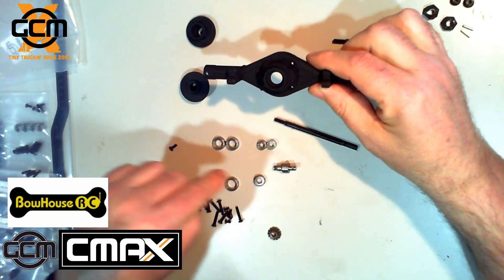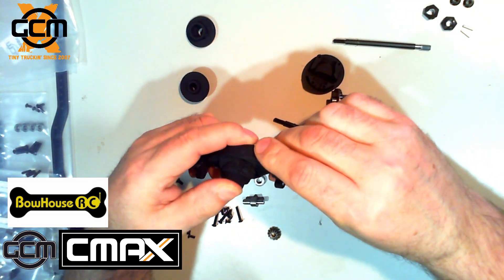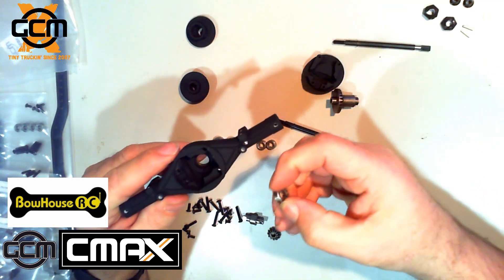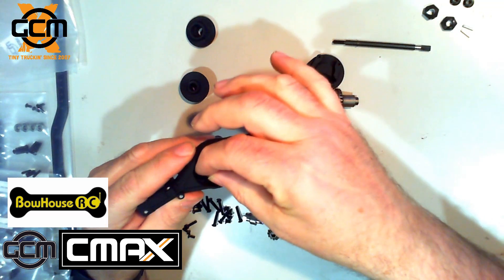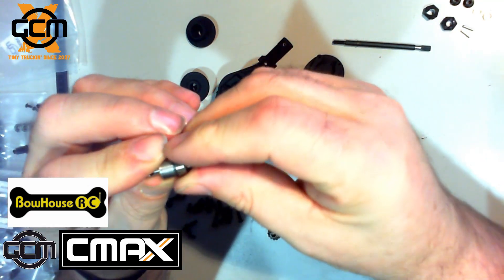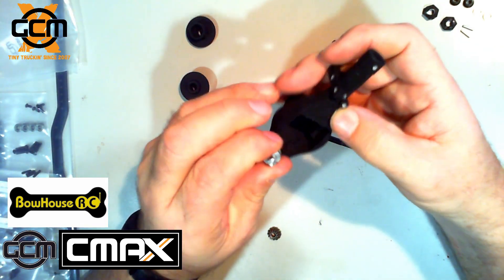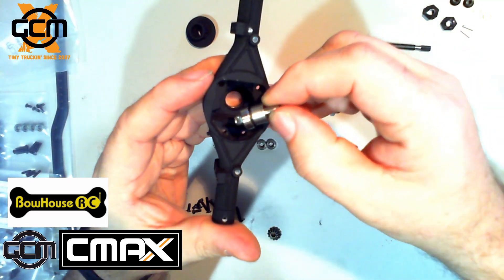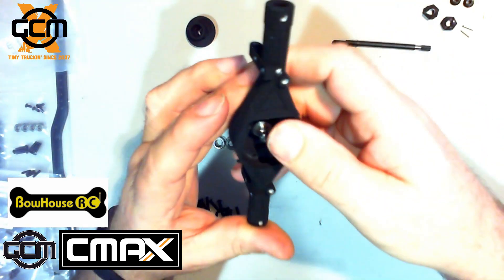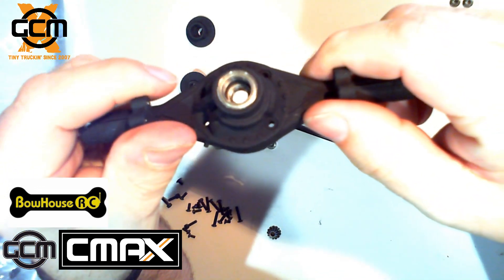This one and the middle one are for the shaft. The big one goes on the outside here — it fits right there. The medium one that's left over goes on the inside. It's pretty deep and pretty hard to put in there. One thing I find helpful is you put the bearing where it needs to go and then use the shaft to press it. Sometimes the shafts are a little bit longer, but in this case it's not. So I'm just gonna push it in there and make sure it's seated all the way.